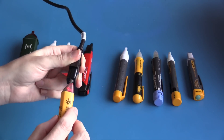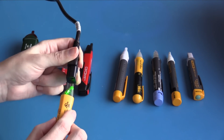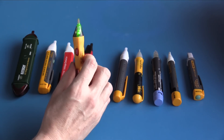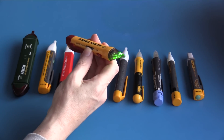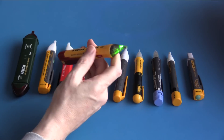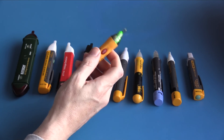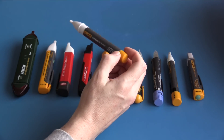On the live conductor it indicates; neutral conductor does not indicate, which is a good thing. On the live cord there is a good audible indicator as well as a very good visual indicator. My one criticism is there needs to be something written on the case to tell you which sensitivity mode it is in. It's a very nice, compact form factor, automatically powers off, and the plastics feel to be of really good quality — a very nice unit.